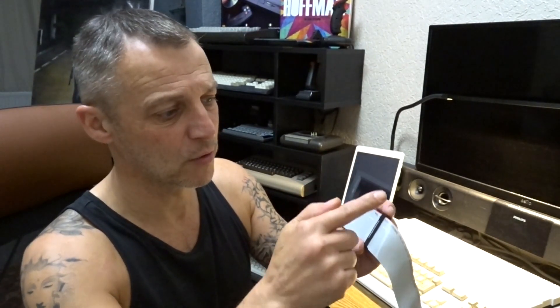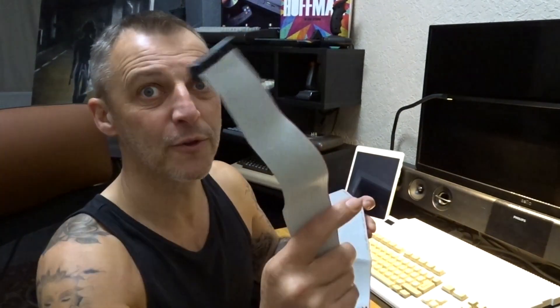From pin 10 here we need to split the cable - split it there and split it there. Then it'll come from df0 up to an external switch we've already got plugged in, go to the switch, come back down and go back into pin 10. When I flick the switch again it'll close that circuit and open up the top one, routing the signal along to the GoTech end. That should work in theory - if you're seeing this video, it worked!